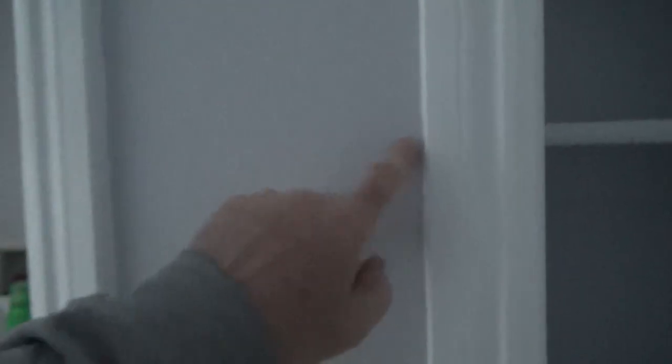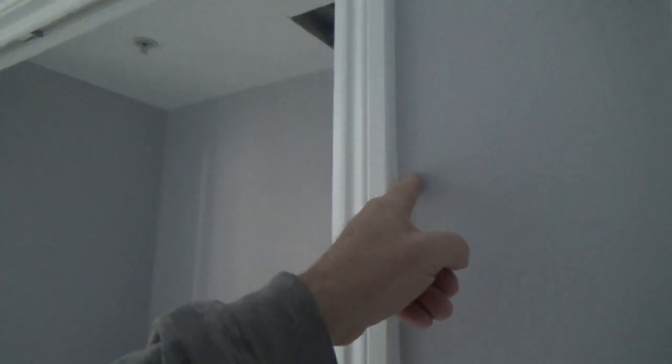It looked nice. Nice and clean, man. Almost looked like I knew what I was doing, huh? Look how tight these lines are. That is paint where I cut in this paint to the door casings. Remember? I painted the door casings first, overlapped it, made sure I got everything nicely painted on the sides. Okay? And then some of the white paint got on to the wall. And I didn't care about that because I can only get this so close anyways with the roller. So I already had a gap like this on both sides.